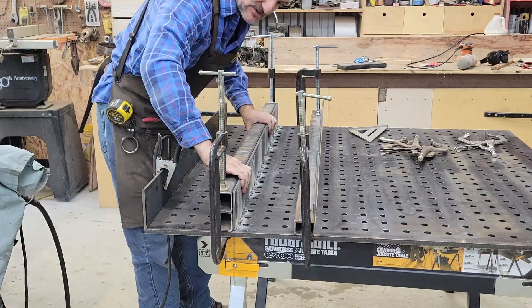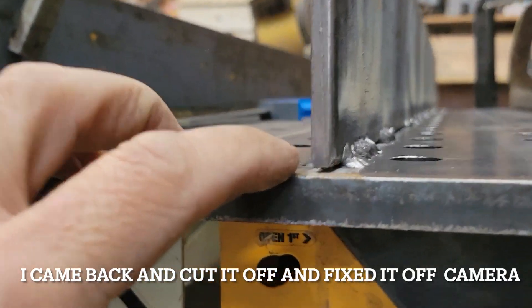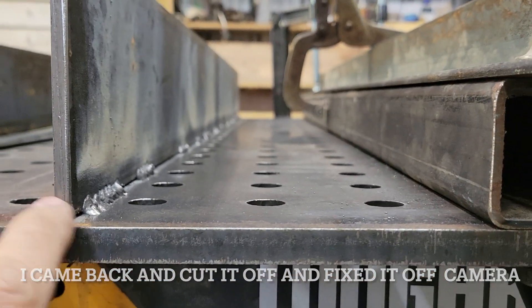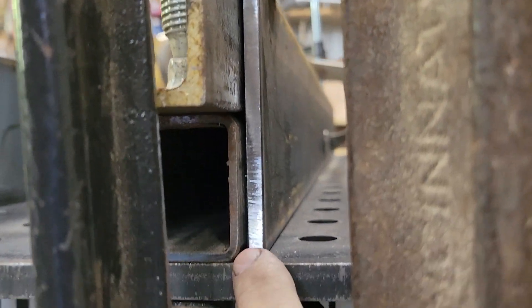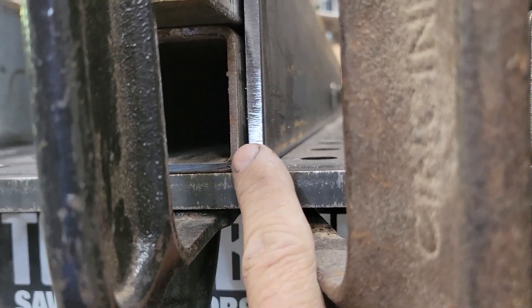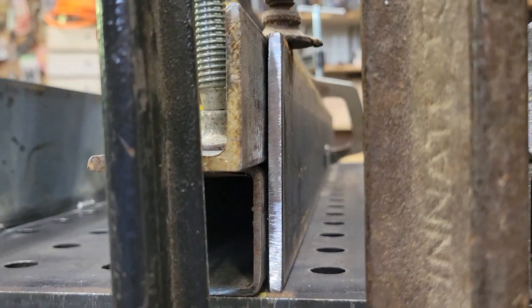We're not transferring too much heat. I noticed that this end over here has got just a little bit of a dip — pretty mild, but it kind of flattens out. To fix that, I went ahead and stuck another clamp on top to bring it up from the bottom and flatten it out so we're getting flat all the way across. We'll tack this side and then go to the other side and make sure it's sitting flat as well.